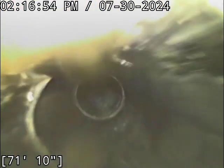Even when a line is graded perfectly, when they're this long, they are much more prone to debris hanging up, especially improper items, as you don't have a specially designed toilet in there that's trying to blast stuff out 400 feet. Same toilet you're going to have on your average sewer line for a regular home. So stuff just is more prone to slowing down. So what I tend to tell people is keep it to folded toilet paper only. No wipes, no paper towels, grease, cooking oil, the stuff you know you shouldn't put down the line.